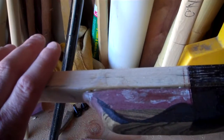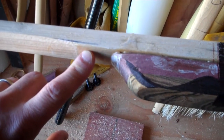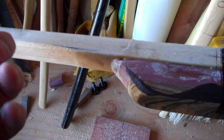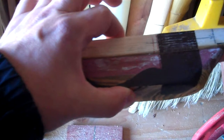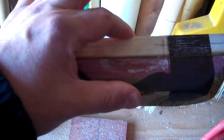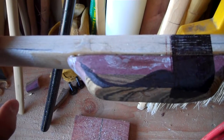Basically what I did was the same process: I put a little bit of glue on the top of this part of the wood and on the bottom of the riser block, let a very thin coat absorb and get almost tacky — not dry, but tacky — then I put a lot of glue, got really messy, clamped these together, held it in the clamps for 24 hours, let it sit for another 24 hours afterward, then took the clamps off and waited another 24 hours just to let it harden up.